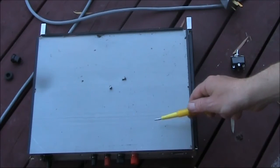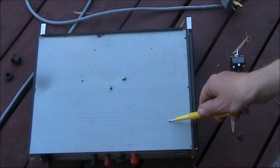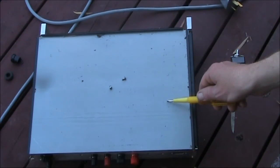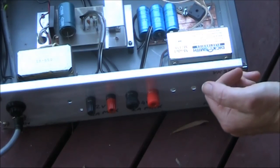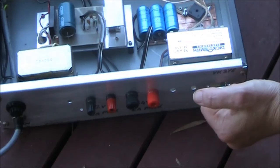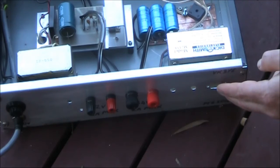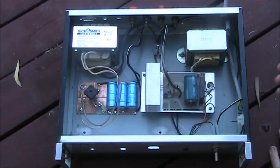The underside of the lid has no ventilation holes. Power supplies generate heat and heat needs somewhere to go, otherwise it makes an electrical item less reliable. This case has a few extra holes from a previous project, but unfortunately some of them are so wide that my little finger fits through — that's undesirable. Ventilation slots should be a lot narrower than that, and even if your finger can't fit through, others in the house with prying hands may be endangered.